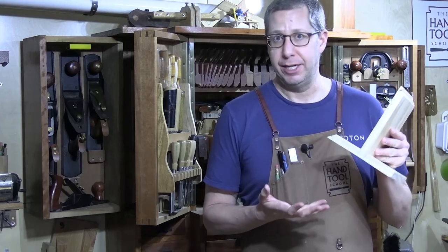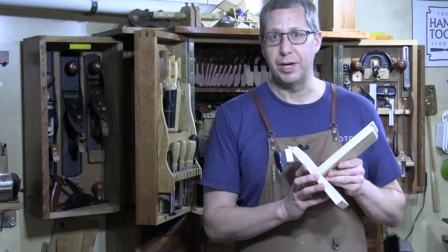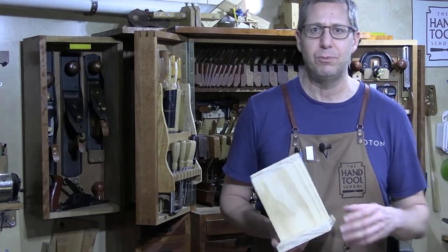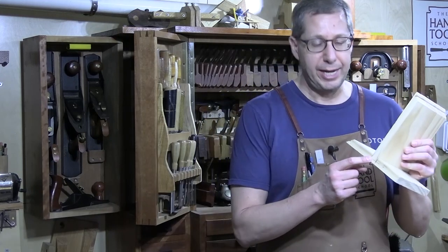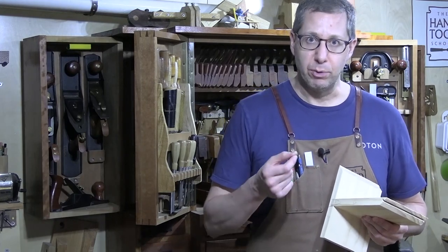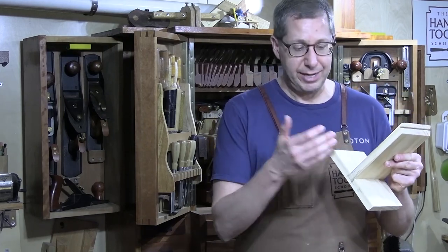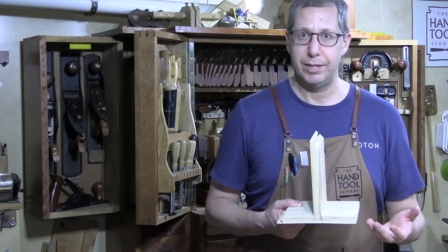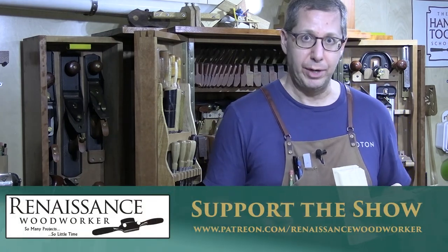I'm not going to pretend that you can't cut this joint if you do have a dovetail plane — but obviously you don't need it, and for something this scale and with this taper I definitely wouldn't want to use one. This is not about using as few tools as possible or being minimalist. What I do want you to take away is that the chisel is ridiculously powerful. Everything you saw me do for cutting this tail was essentially done freehand — just a chisel, working to a line. Honing your ability to use a chisel, even with tail angles and socket angles and taper angles and square angles all going on, it's all just lines that you need to work back to. You hit those lines, you hit your joint — and it can be done more efficiently and more accurately when you can see what you're doing by using just a chisel.